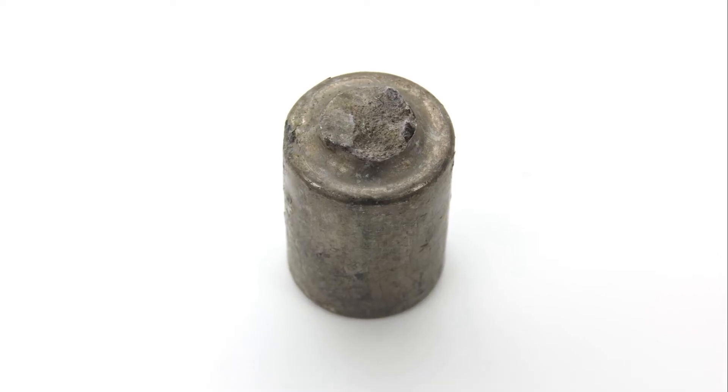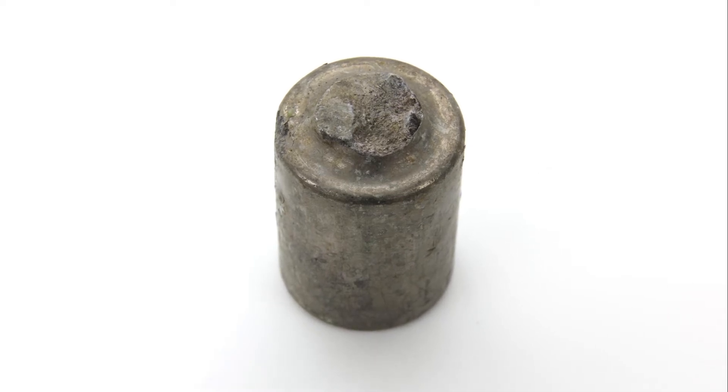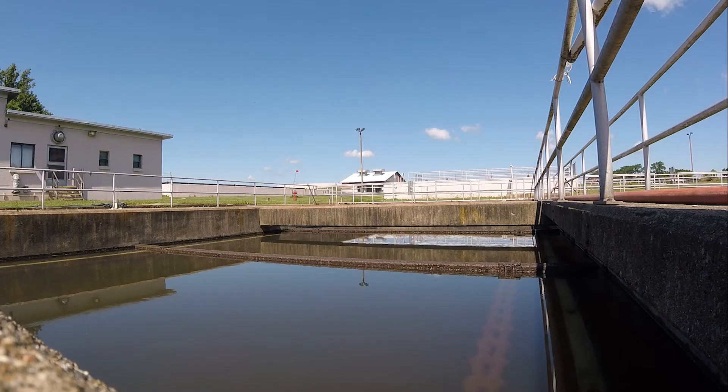In this example, the fatigue pin's surface is not a nice uniform shear, but has a rough surface complete with beach marks. Fortunately, the pin has done its job to avoid larger failures, but we need to do our job to understand the root cause. Ripples on the water's surface also indicate a small snag somewhere. This stresses the pin, which over time will result in fatigue failure. The magnitude of the snag will determine time between failures.